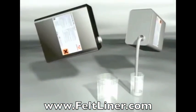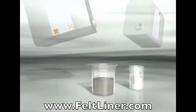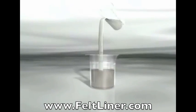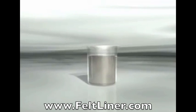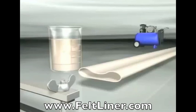The first step of the lining process is to mix the resin in either a 2-to-1 or 4-to-1 mix ratio, depending on the desired product. Once both components are in the mix bucket, it's important to make sure the resin is mixed properly, without air bubbles or colored streaks.